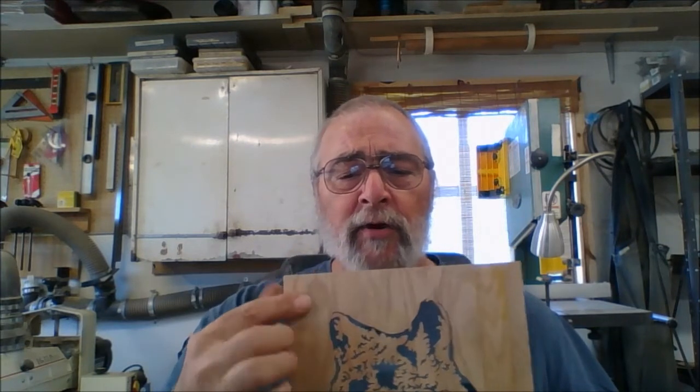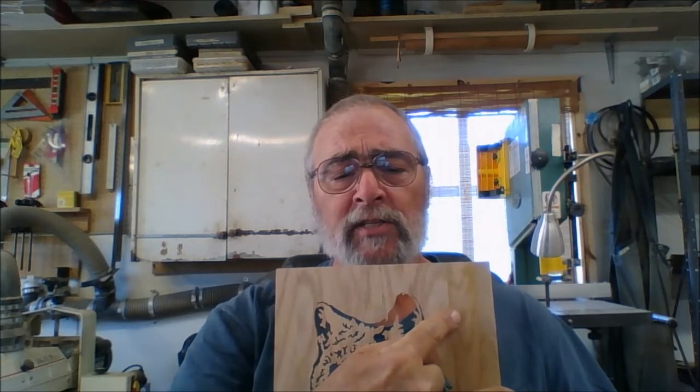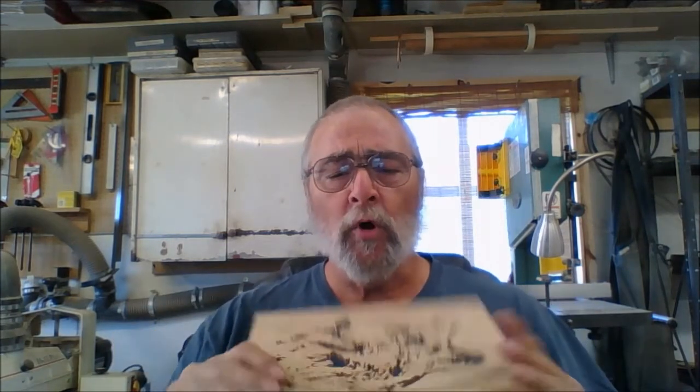If you can see, the grains on this actually don't go together — you can see right here as a good instance. We take strips of this oak and we actually glue it up to make a solid panel. And it is solid, guys — solid oak. The way we rip that, it strengthens the board.